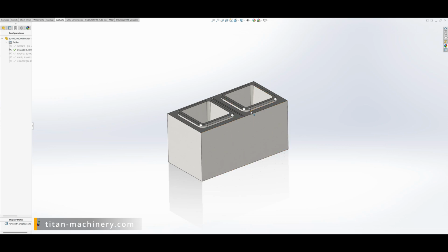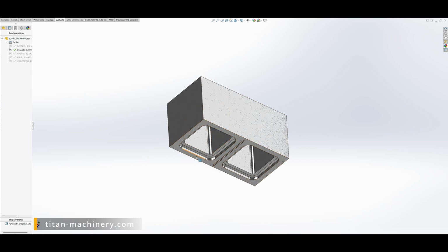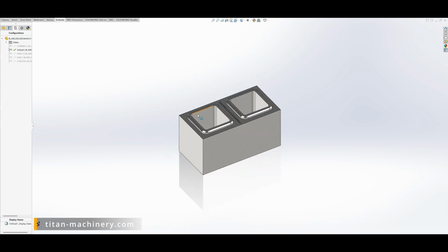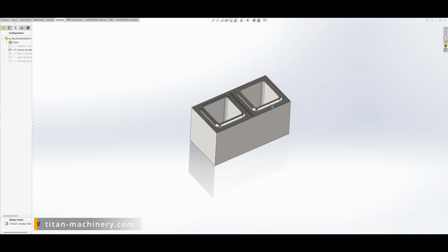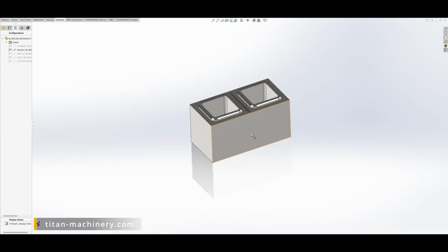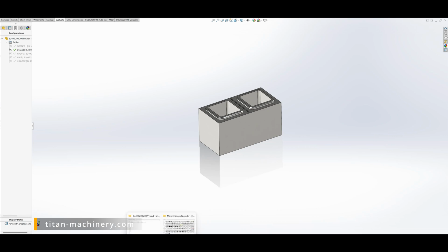Because standard vibration block making machines have flat surface from the bottom. They have a different design, so they cannot produce these indents and this interlocking protrusion and indents, which are congruent when these blocks are assembled together. So this is the greatest advantage for our blocks. Another difference lies in another thing.